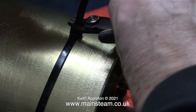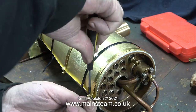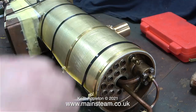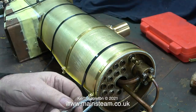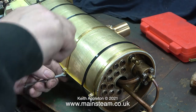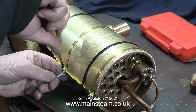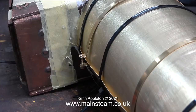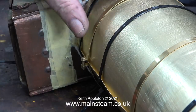A quick word about making these boiler bands — try and think it through. The first boiler band is going to be used as a template for the rest, and that is assuming you're cladding a parallel boiler, not a tapered one. Ideally the bands need to be at the correct tension when the gap is closed completely. To be honest, I don't always get this right but in this case I did. Knowing where to put the bands is another matter — I think I won't have quite enough to make every band, so I'll have to compromise to start with.